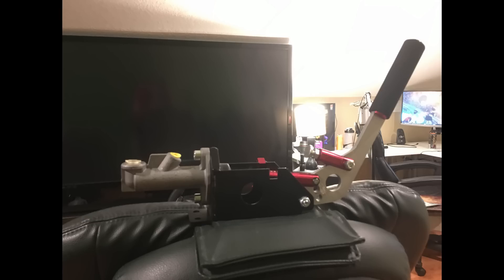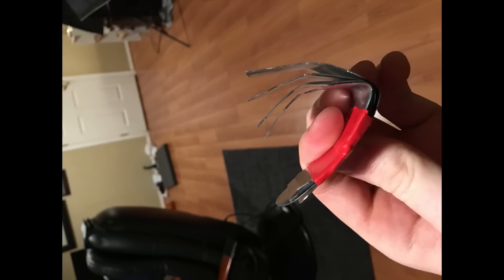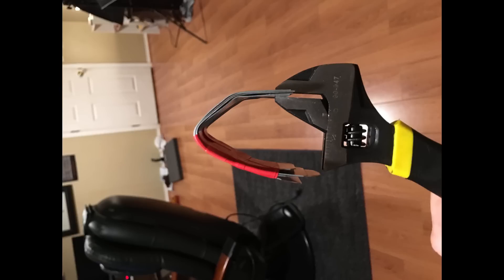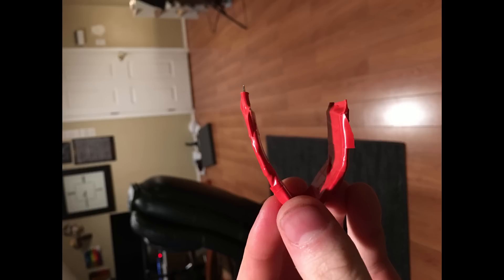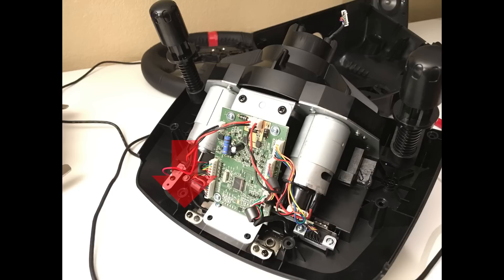Okay so here's the first photo — you can see the cylinder in the back where you hook up the hydraulic stuff. I took that off. Here's the 6-inch M8 1.25 bolt going all the way through, and right here you can see the aluminum strips — I've got four of them cut about an inch wide and six inches long. Put them all together, held them with a vice grip, taped it all together so it'd be nice and strong — tight, like one piece. I decided on thinner pieces because they're more malleable.